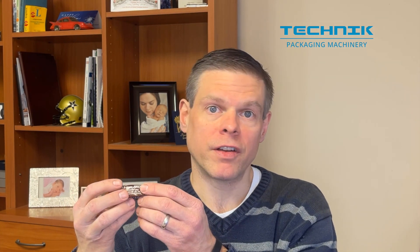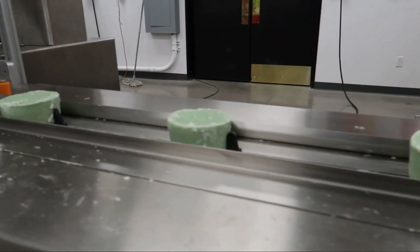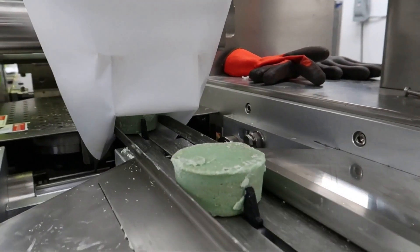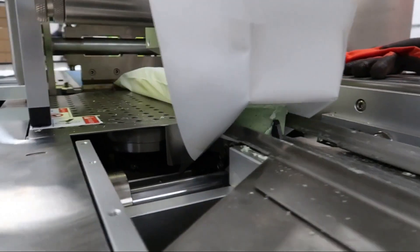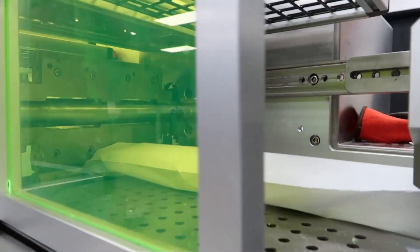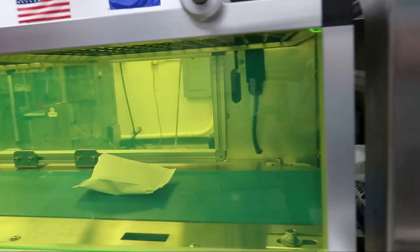But what if you have a candy bar or a baked good — some solid product? Well, those we can package on a machine called a flow wrapper. The concept is very similar to a vertical form fill seal machine set on its side. The product, in this case a candy bar, moves sideways on a conveyor belt, the film is wrapped around it, we make our fin seal as we saw in the other bag, either on the top or bottom of the bag, and then we make our cross seals at the front and back and cut off the finished bag from the bag before it.